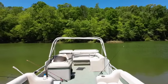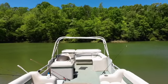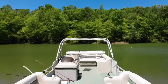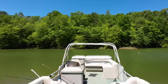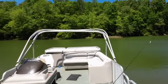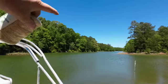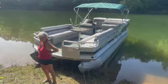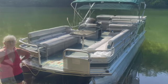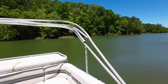When your top is too small on a pontoon boat, that means one end or the other kind of stands way up in the air. So I took that off and put a 12-foot on it. The 12-foot was a little larger than the 10-foot or the 8-foot, but it also sat lower, so I had to readjust my rails. The reason it sits lower is that the height of the top is very much determined by the size of it. I've got one post that's anchored - you can see it back there - and if your top is longer, when this part comes forward it's going to come further down. So I had to readjust that and got it on where it fits nice.